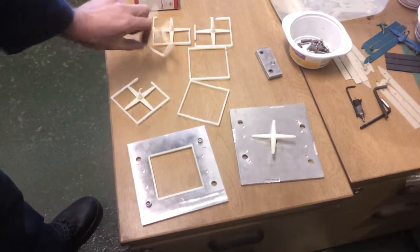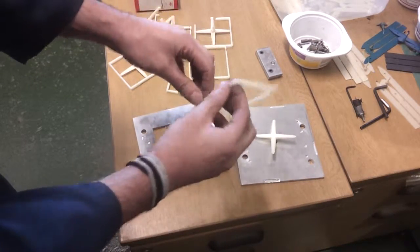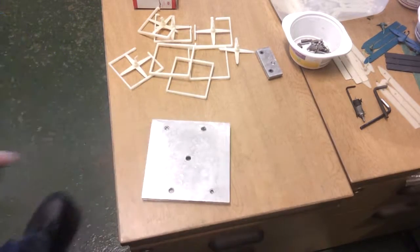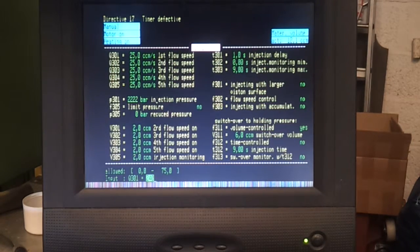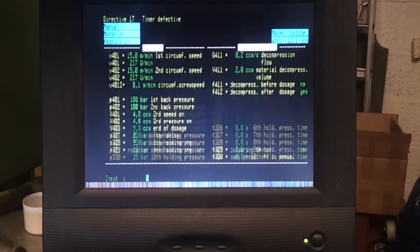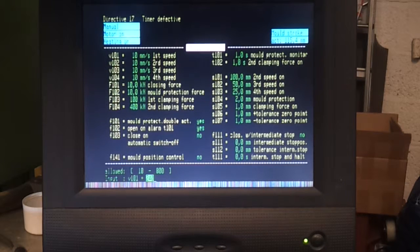After a few cycles with some short shots I'm starting to get complete frames now — that just pops out quite nicely. There is a bit of sinking around the edges which I'll try to fix. On record, the temperatures I'm running at are about 240-250°C for ABS — a little bit hotter because there was some nylon in there beforehand. Injection speeds are modest, high pressure but that's the limit not the actual injection pressure, ridiculously long holding time and high holding pressures. None of this is making a great deal of difference — I'm still getting a lot of sinking, even up to 40 tonnes of clamp on the mould side. I'm going to try a different material and see if that makes any difference.